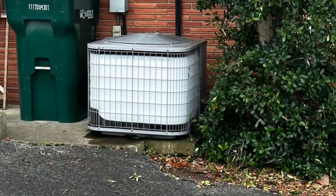A customer called and said the heat pump was frozen, sent me a picture and it looked like a block of ice. What can cause a heat pump to freeze like that and not thaw out? One: low on refrigerant — we're going to check the refrigerant and show you how to hook up gauges. Two: bad defrost controls. You're watching HVAC Tips for Technicians, I'm Tad. Let's get started.